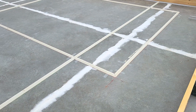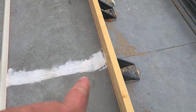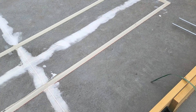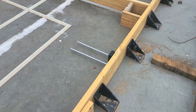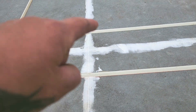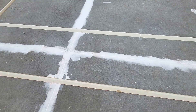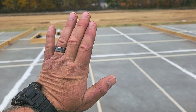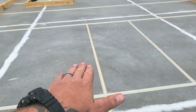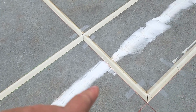You can see the two different colors of concrete here. The concrete inside where our tilt panels are going to be has a wax coating over it — that's our bond breaker, so the new concrete poured for these tilt panels doesn't bond to the old concrete. We've also gone along all our saw cuts for the floor and filled them in with drywall compound so the saw cuts don't show up in our wall panel. The bottom of this slab will become the outside of the wall once it's lifted into place.